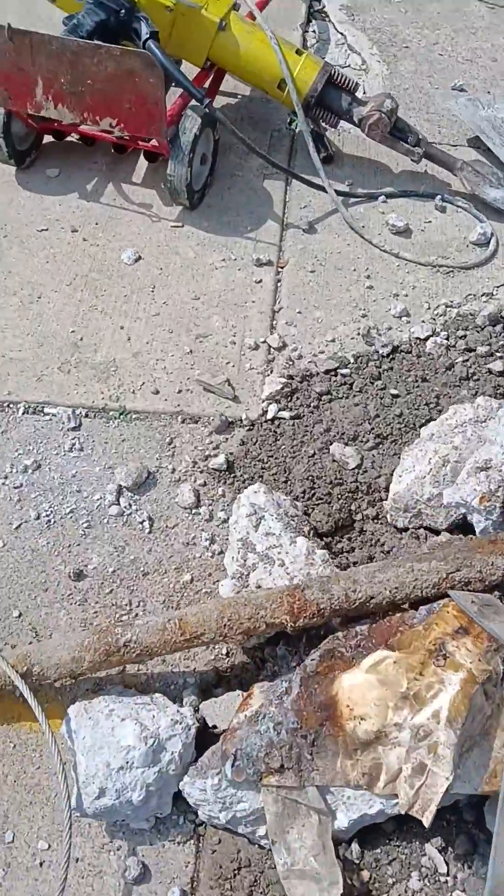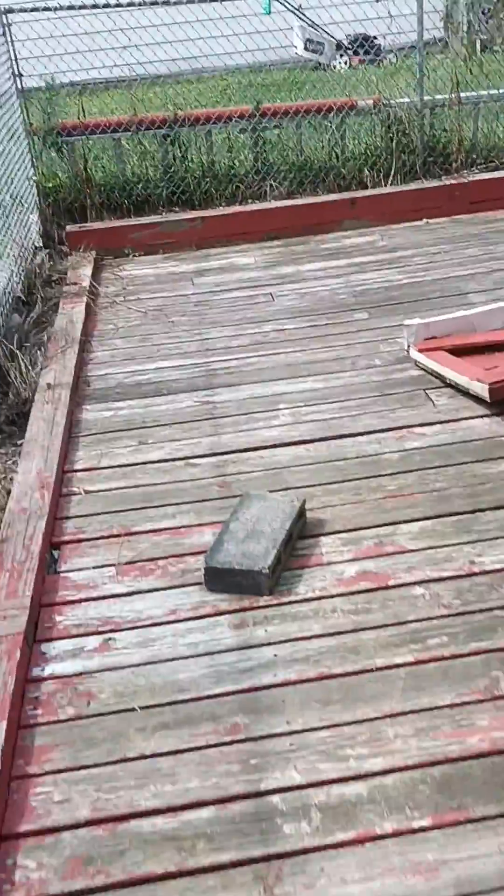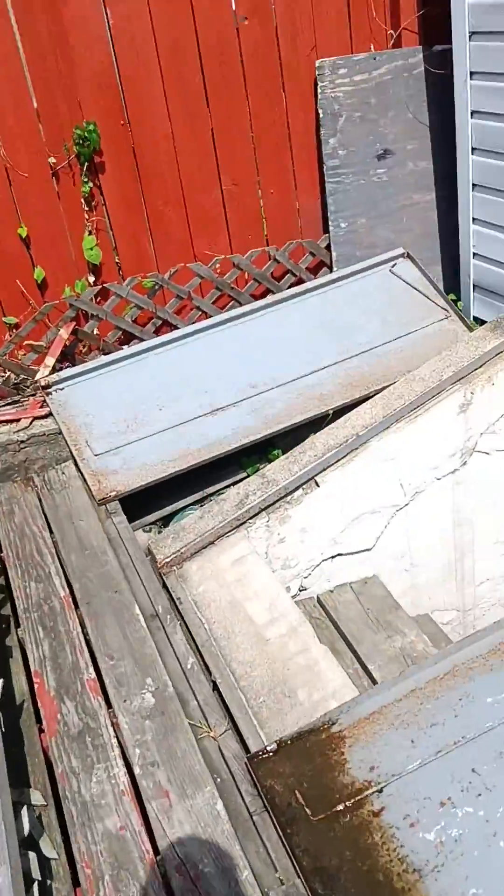Take a look inside here. We have our coil of pipe down here in the basement. Tracer wire down here. This is where we're gonna put on a service head adapter and this is where his meters will be. They have to have inside meters because there's a porch and there's no way to get a meter set out on the sidewalk without disturbing traffic. Here's the coil that was in here.